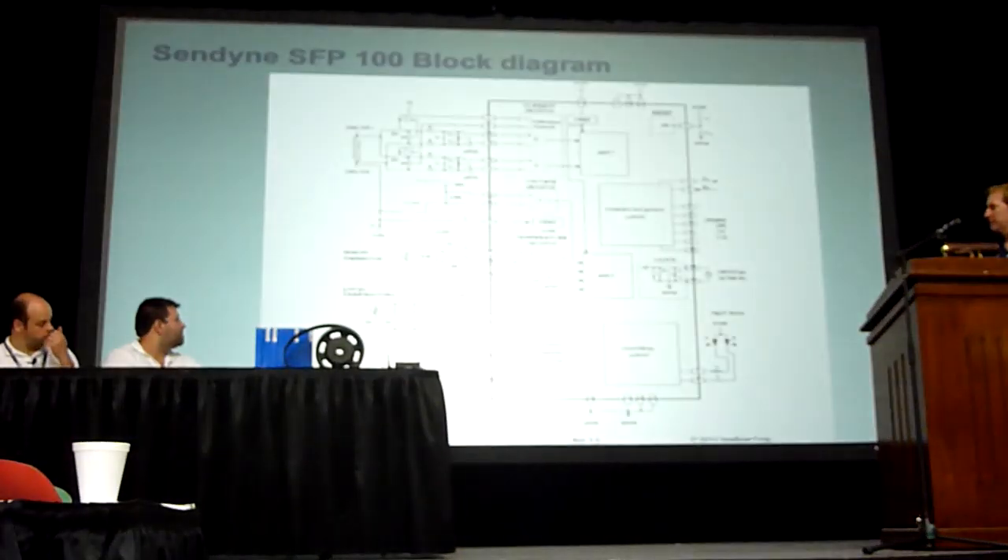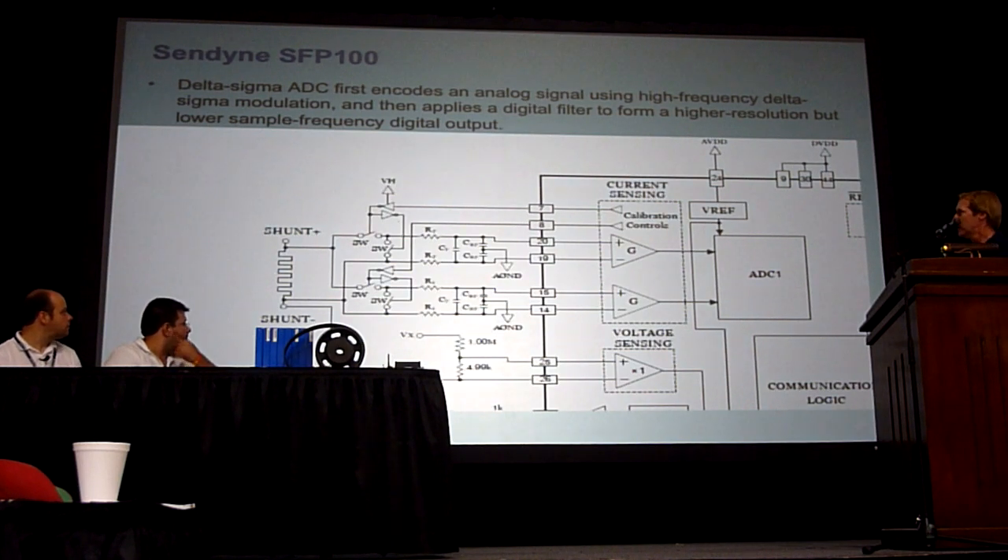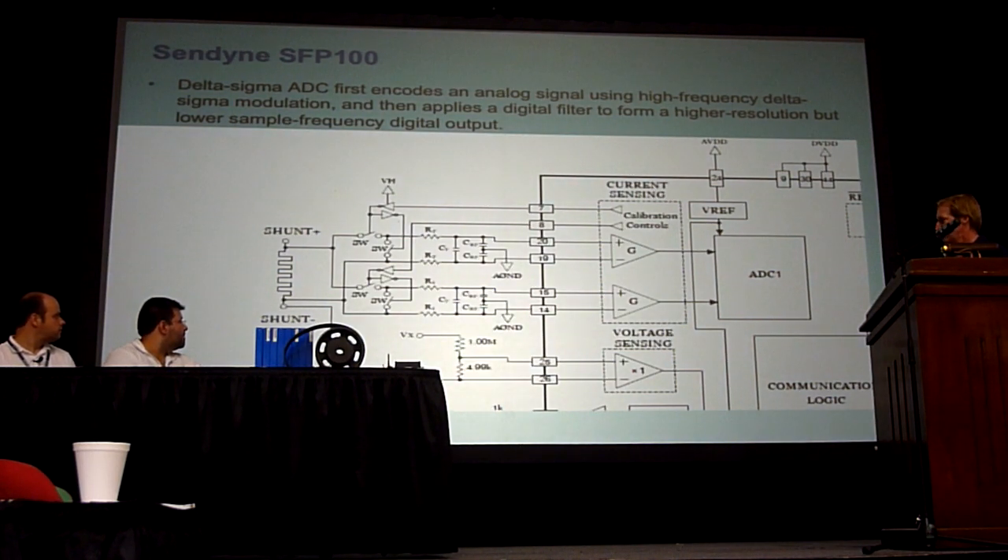The thermistor capability is not really guided toward or needed for the pack — they didn't really think about the pack. It's really about measuring the temperature of the shunt. The reason is that accuracy comes from knowing the precise temperature of the shunt. The shunt is connected to the outside world through wire, and that creates a dissimilar metal contact — basically a thermocouple — which generates an EMF under temperature. When you're dealing with microvolts, that can affect your measurement. So they use a lot of shunt temperature measurement to compensate and get high accuracy.